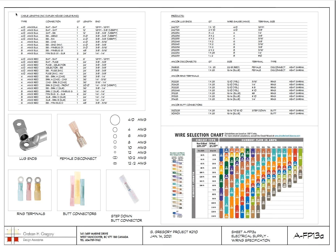Here are the cable lengths — a full breakdown of the wire, what it's for, quantities, and lengths. This is also a takeoff of the lug ends we need. The size of the opening on the lug end matters because the termination varies depending on what you're hooking it up to, and the gauge of wire also varies. The ends are specified: 1/2 and 1/2, 1/2 and 3/8, 3/8 and 3/8, and so on.